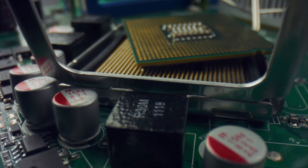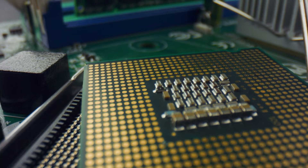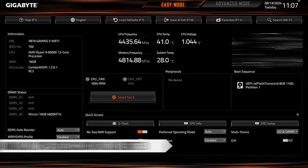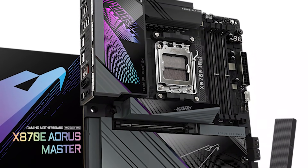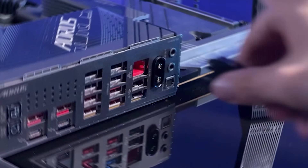This VRM configuration is more than capable even for the most demanding CPUs like the 9950X3D. Considering AMD's Ryzen 9000 line is highly efficient, this power delivery is perfectly viable for any CPU. However, keep in mind that manual CPU overclocking will be a bit limited. You won't get the same results out of this board as you would with higher-end X870E boards — though of course, that's to be expected for the price.